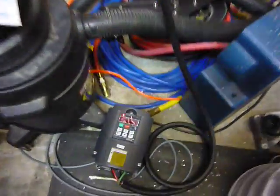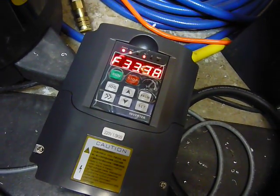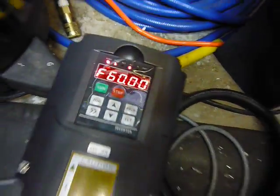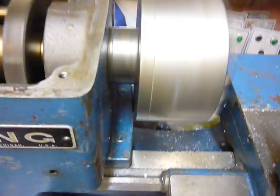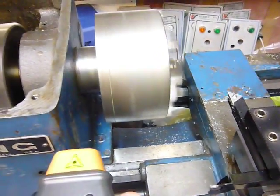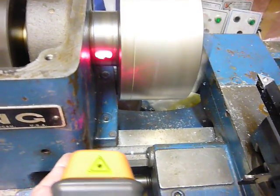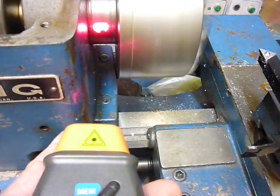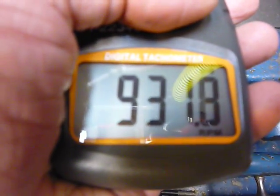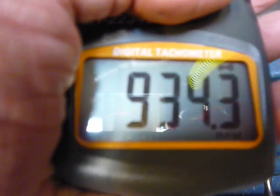So I'm going to crank up the lathe, fire up the VFD, and it's ramping up — you can hear it in the background. There it is, heading to 60. So we're holding at 60 hertz right now. You can see that little white strip in there — that's the reflective tape I've attached to the spindle. Being careful not to get into any of this moving stuff, I come over here and press the test button. It puts a little laser, a targeting laser, out there. It'll work anywhere between 2 and 10 inches away. Put it right on the strip — we're reading 930, 932. So that's RPMs on the spindle motor, about 934.